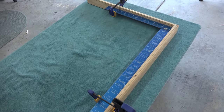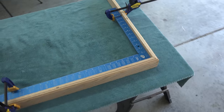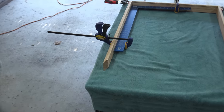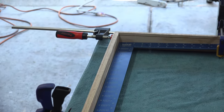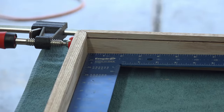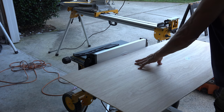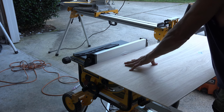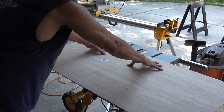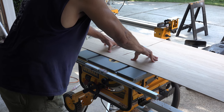At this point I'm ready to join my top and two sides. Remember to leave your bottom unattached. I will put a little wood glue on the corner and squeeze them together with a clamp, then use a square to ensure my corners are a perfect 90 degrees. I will place a few staples in them, but wait until the glue sets so they don't move. While waiting for that to dry, take a measurement from relief cut to relief cut and cut out your back plate. You can place your bottom piece in position long enough to get a proper measurement to continue cutting the complete dimensions.